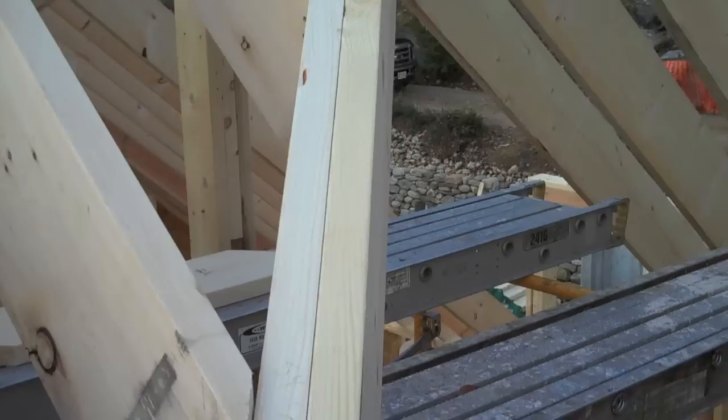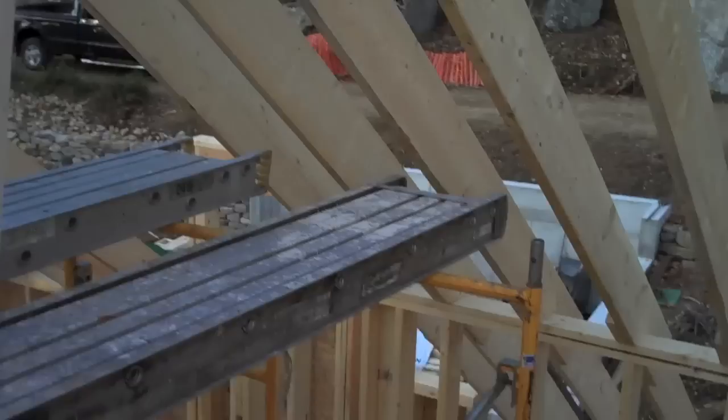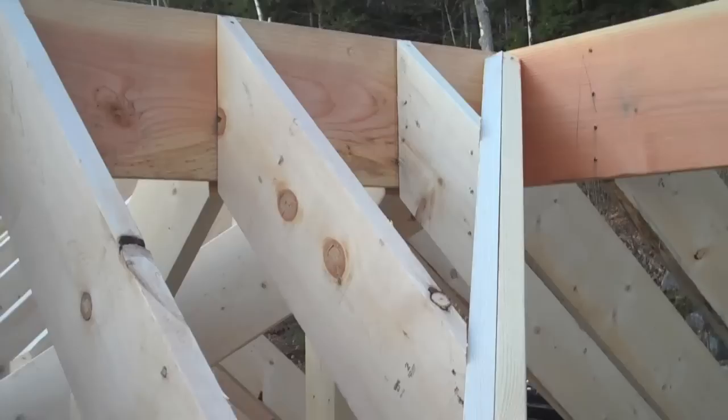You can see it's a very unusual cut — it's a compound cut on that rafter. Not only do they have to cut the angle this way, but they have to cut a 45-degree angle this way as well. This is called a cheek cut on this particular rafter where it intersects the valley. You can see it's a gorgeous cut — you can't even put a piece of paper between that. It's cut at an angle here and at an angle here, so that's a compound cut. And of course it takes all of that weight from this side of the roof, as well as the side where they have not yet put in the rafters.